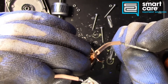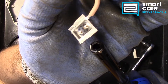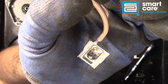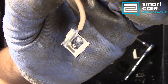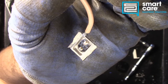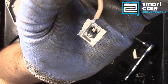I bet if we heat this surface it will probably pop — let's try it. There it goes! Now we watch it cool down and it should pop back. You can see they've kind of rolled that metal into a bowl shape, and when it heats up and the bi-metals expand, it kind of crunches itself and forces itself into that open position. It should auto-reset — it should cool all the way down to the point where the forces on the bi-metal make it snap back shut. And there it goes — how cool is that? Let's do it again.